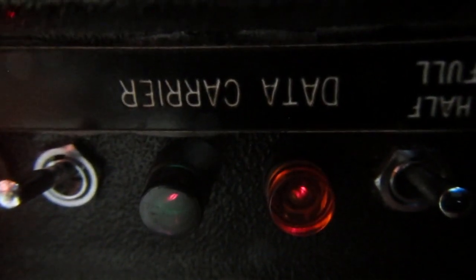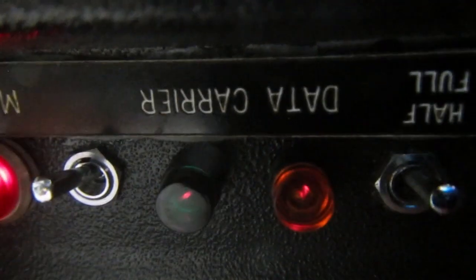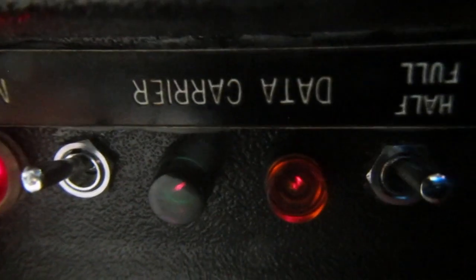Because normal lamps will burn faster and break faster if they are subject to large thermal shocks. In this way the filament is always lightly warm and can withstand the on-off switching of the indicator lamps for a longer time. So this is really a well thought-out circuit.